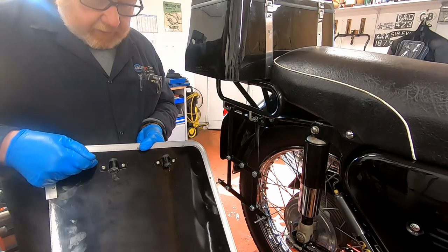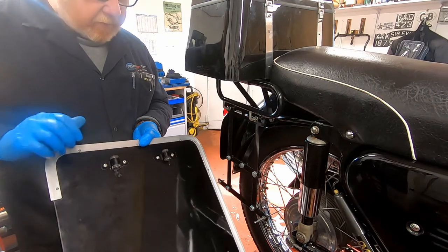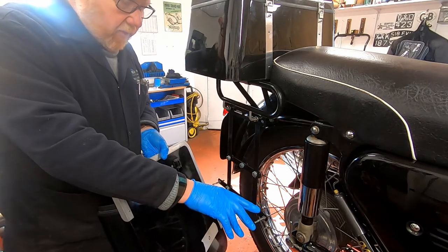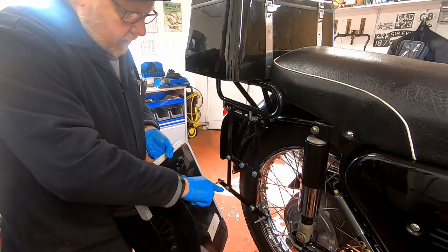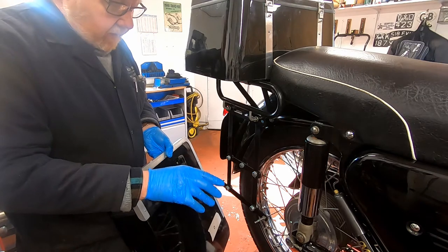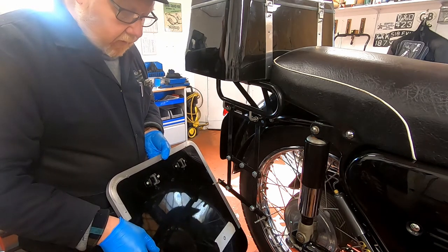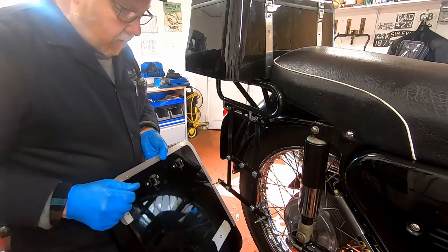I put a little bit of grease into these rubber bobbins and a little bit on the pins, and that's helped no end to slide this on and off. I've marked off where the holes are going to go for the pin locks. They're roughly in position — not tightened yet — but I've got a little movement either side, plus up and down, and this member here can also be moved, so there's loads of adjustment. I think the next stage is to go ahead, get these drilled out, and get the pin locks installed.